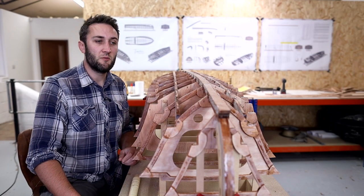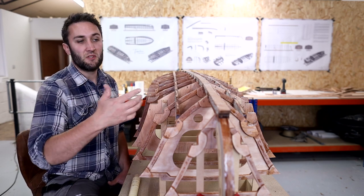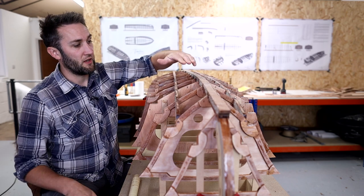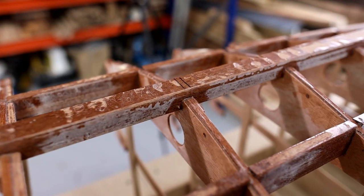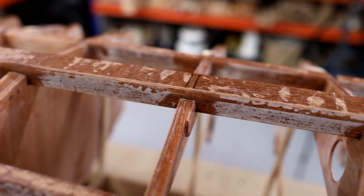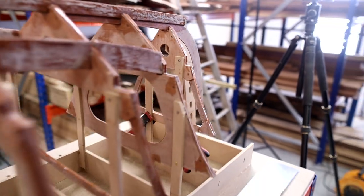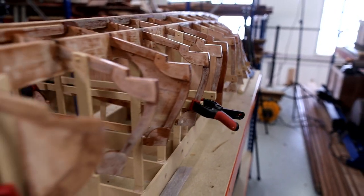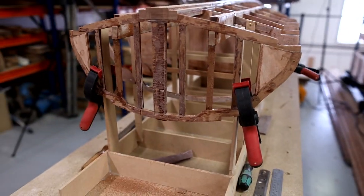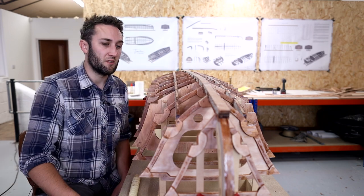The time has come to start doing some beveling on the bottom of the boat. Everything visible here at the moment is currently square - the keel is square, the stock is well oversized so we've got plenty of material there. Same with the stem, and the frames have been cut on a CNC which means their edges are perpendicular to their faces. Particularly in the forward frames, those are going to need to be beveled as the sides and bottom of the boat all come into a point at the stem.